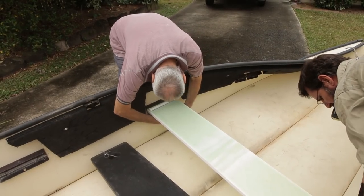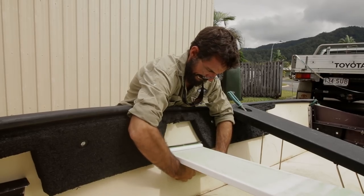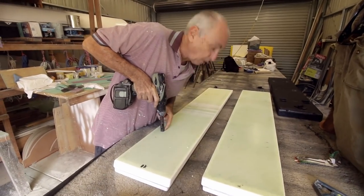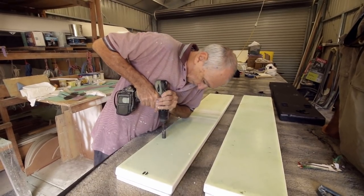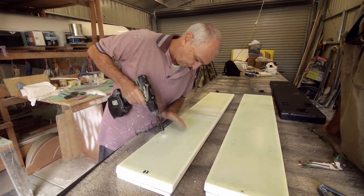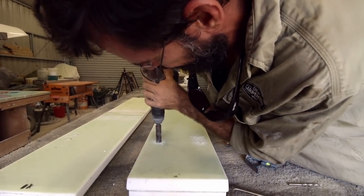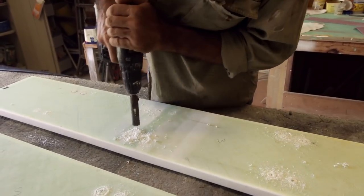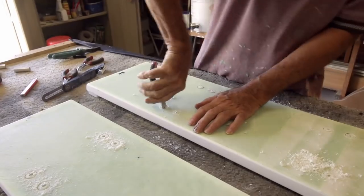We also needed to put the seats in place and mark up where the holes for those keeper pins had to go. Next we wanted to make epoxy cores to screw the leg supports into, and David showed us his method. We were using a small hole saw, but careful not to go all the way through — stopping at the layer of glass on the other side of the polycore. Once the drilling was done, the waste was pulled out with a small set of pliers, leaving a hole for the epoxy resin.